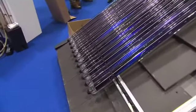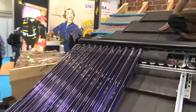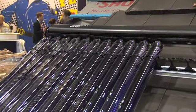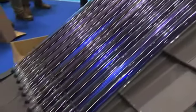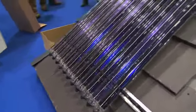Ah, right, okay. Plus, you don't fit them too close to the edge of the roof where you've got a higher wind load. In fact, they have to be about a metre away from the edge of the roof, don't they? That's right. And wind loading is something that you will do a wind loading calculation for as part of your design at that stage. Now, this product's been tested and approved under those standard conditions.